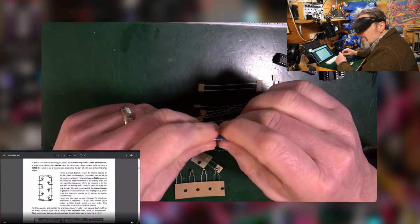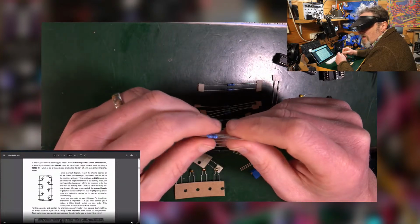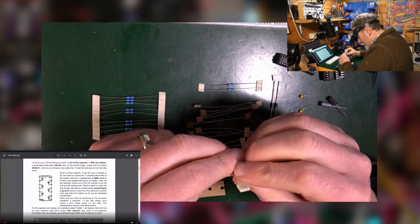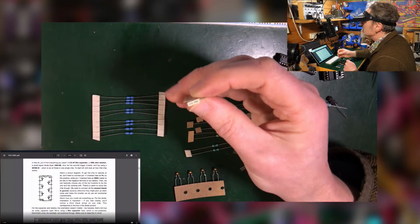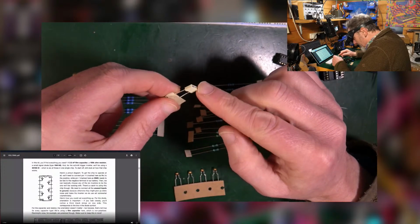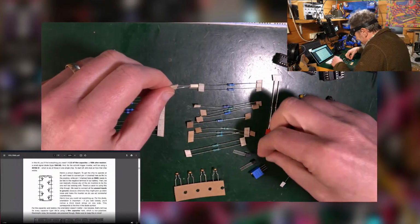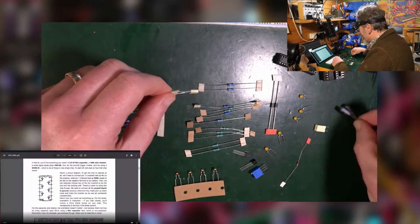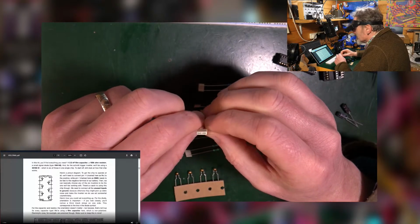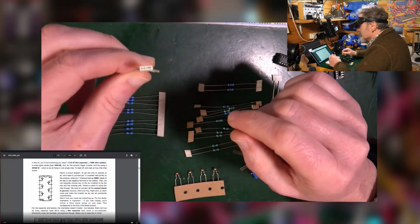Okay, so who's got your resistance calculator out? 2.2 is one of the white ones. Just about make out the writing. Oh yeah, look, 2.2, J100. This one? You reckon it could be that one? I think I'm right in saying that the square ones are the film capacitors. These are ceramic capacitors. And these are electrolytic, which make me sound like I know what I'm talking about. So yeah, that does say 2N2 on there, which is how they write 2.2 nanofarad. That could be it.